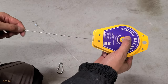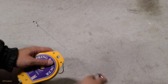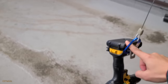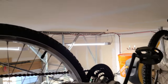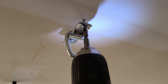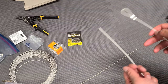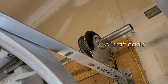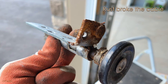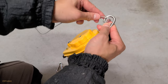First, you have to buy this little gadget from Amazon — it's called a spring balancer. This is usually used in factories on the assembly line to hold tools suspended in the air. You only need very little effort to hold the tool; it's basically like weightless. I am installing an anchor point on the ceiling using wood screws to secure it to the stud. For serious DIY people, you should have some aircraft cables in your toolbox — it's the same cable that holds your garage door. I am using stainless steel instead of galvanized. Here we are making a cable that is going to attach the spring balancer to the ceiling.